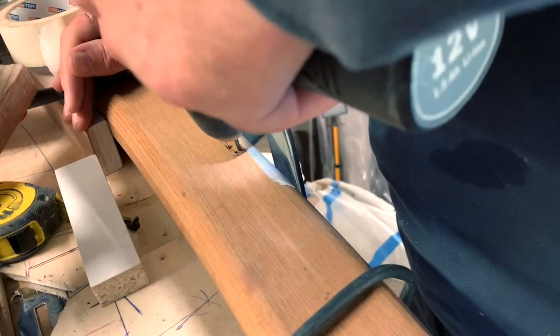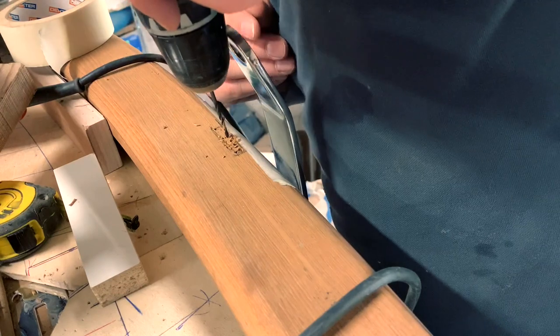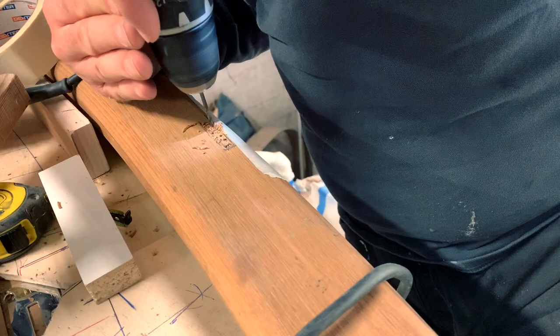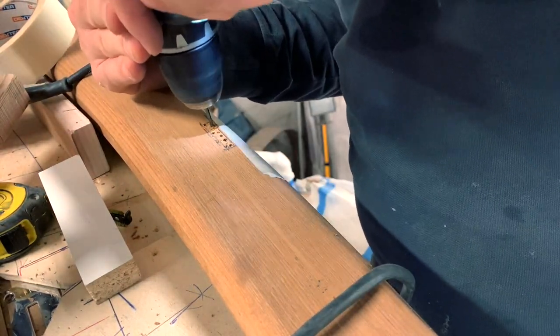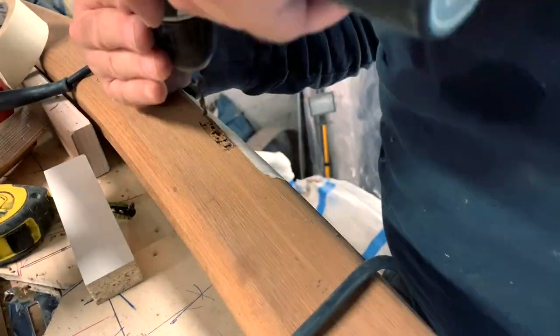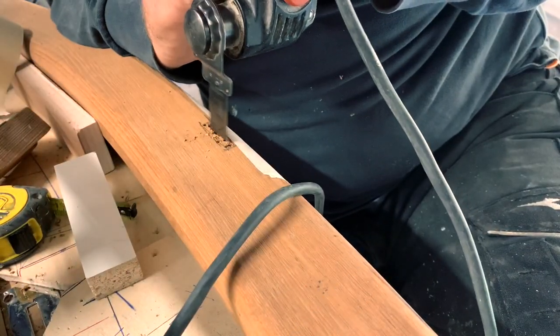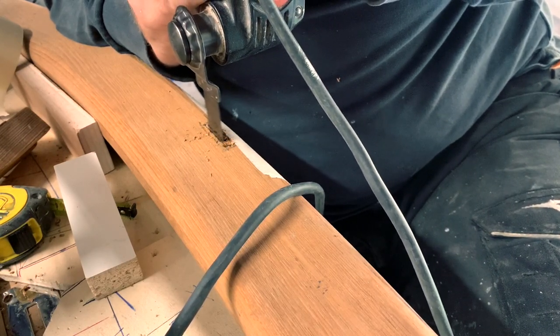It is a painstaking work where no errors are allowed, so very calmly I make the holes and check, triple check any single one, because any mistake needs to be avoided, or you throw away all your capping rail. No way, guys. Also, the Fein helps a lot. It's probably one of the best tools that you need to get when you restore a boat.